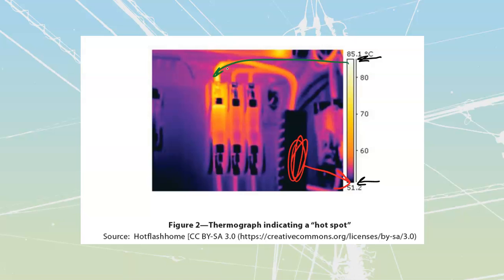Over here you see that this thing is running up close to 90 degrees. Since 90 degrees is the maximum for most of our general usage types of wires, this thing's probably not going to be fine. In fact, if it's a breaker, almost all breakers are going to be rated to 75 degrees. You can find that inside of Appendix B of your Canadian Electrical Code, where underneath 4006 it tells us that if things are tested, they're going to be tested to that 75 degrees.